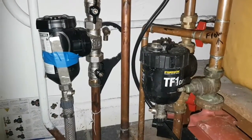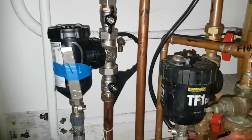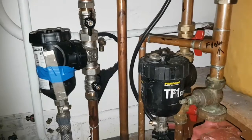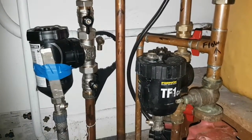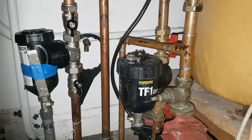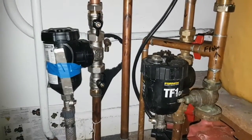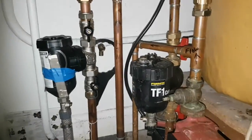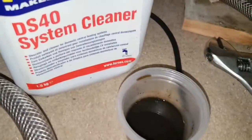The compact TF1 certainly catches more, and I was a bit concerned that the Vortex 300 allowed so many particles to flow through it. Unless someone says to the contrary, I'm not 100% convinced the boiler doesn't manufacture or bake those smaller pieces into larger bits which then get picked up by the compact. In theory the Vortex should catch almost everything, but it clearly doesn't.